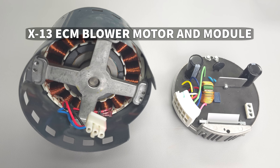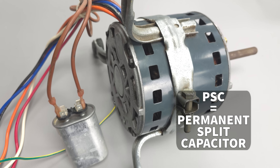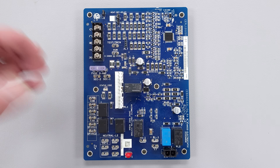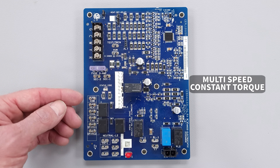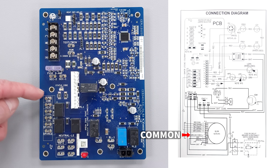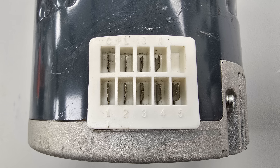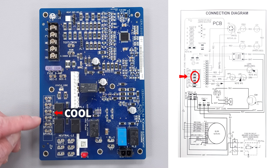These are the newer gas furnaces over the last say 10 years. The types of blower motors we had before were just a straight 120-volt PSC - a permanent split capacitor blower motor that required a capacitor to start. The newer blower motors are not like that. In this case it's referred to as a multi-speed or constant torque electronically commutated motor, an ECM motor. You're going to have a common over there on the terminal of the fan motor, and then you're going to be supplying that fan motor with 24 volts on one of the five speed taps. Those speed taps are programmed by the factory as far as how much air volume it's going to be blowing. You have three right here: a heat, a cool, and a fan.